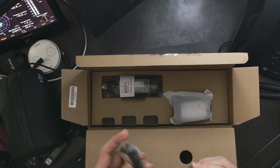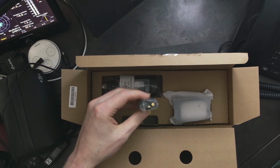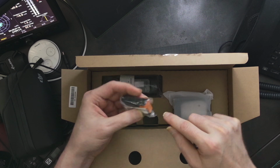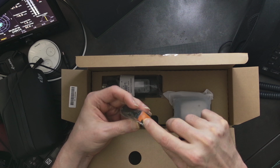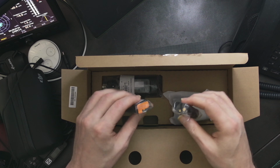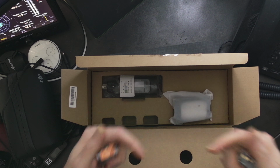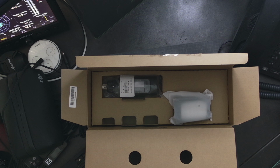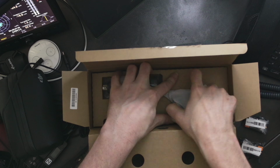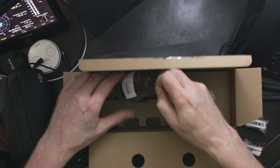I'm not the fondest of these. I've used them with the ULXD. And the problem is the little prongs that hit this connector and the one over here go bad after a while and stop making contact, and you have to constantly bend the prongs back in order to make contact again, which is a little frustrating.